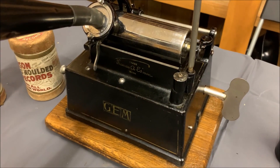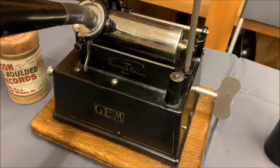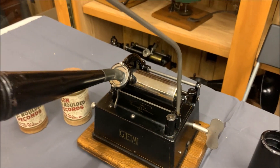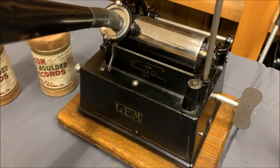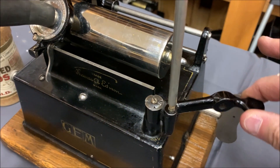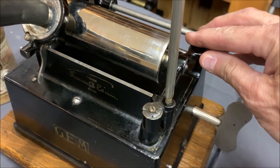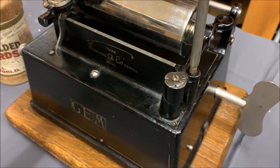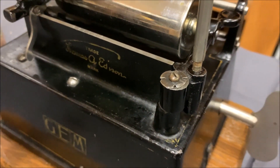So why don't we give this machine a try? As I was setting it up I noticed that the crane is anchored to the right side of the machine and not the left — usually it's anchored on the left side. I realized that when you move it, you end up moving the crane and the horn at the same time, and maybe that was the reason why they moved it to the other side. I also noticed the slot for the crane is a little smaller than the later ones, so the crane must be narrower at the end that goes in there.